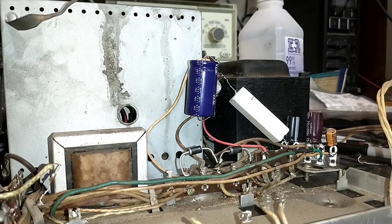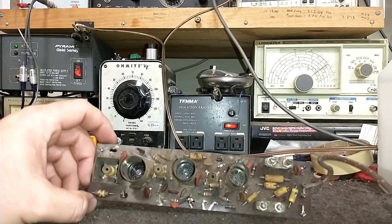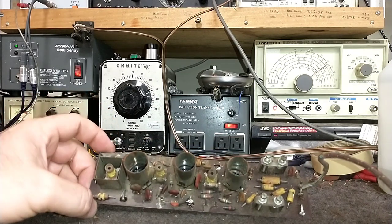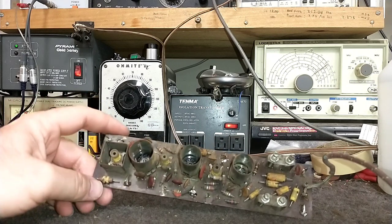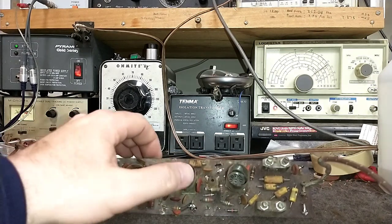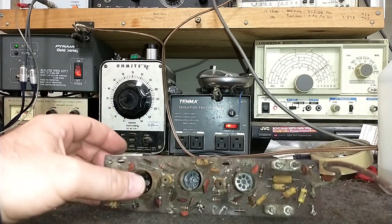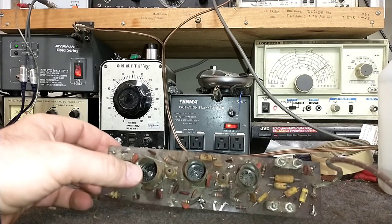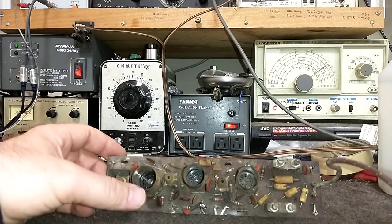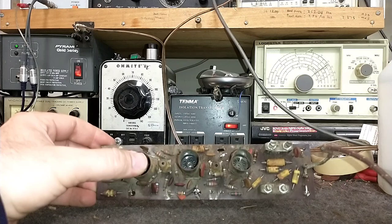So here's our IF board — it's pretty dirty. I'm not going to use the aggressive cleaning method I did on the main board, because there are lots of fragile coils that if I damaged them, we're SOL. We've got one 9-pin socket to replace and two 7-pin sockets. Thankfully they just have the solder-adjacent terminal shield, so we don't have to come up with anything fancy like the integral slide-up shield on the main board.